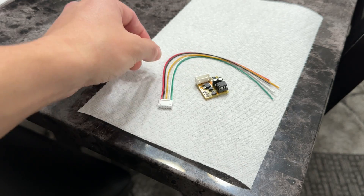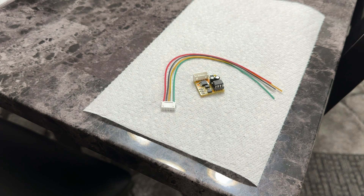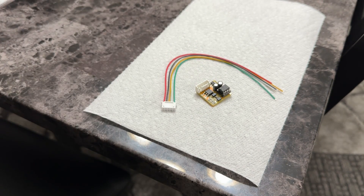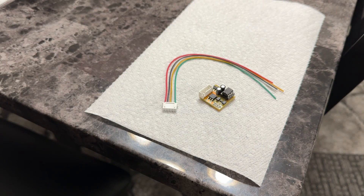It'll come with the board fully assembled and the pigtail to wire everything up. This one is going out to a customer in the U.S. who has an M66-swapped 850. I also had one of these boards being run in Canada on a 2000 V70R that was M66-swapped with the P1 shifter, and he's been using it for a couple of years without any issues. I have a whole bunch of these boards, the components, and all the software is done. It's a fully-fledged working product that I can start selling because a lot of people have M66-swapped P80s and don't have that reverse lockout functionality working.